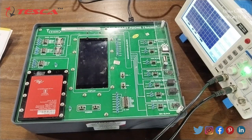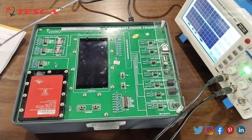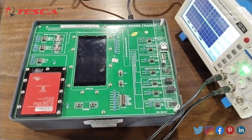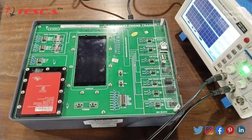Now for FS SW5 mic block — if I block pin 1, the positive terminal of the mic gets disconnected, and hence we will not be able to give audio signals through the mic. For the hands-free mic block FS SW6 — if I block pin 1, the mic gets disconnected from the earphone. If I block pin 2, the speaker gets disconnected and hence we will not be able to hear audio signals from the earphone.